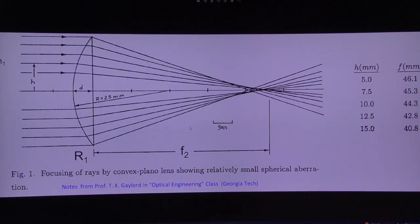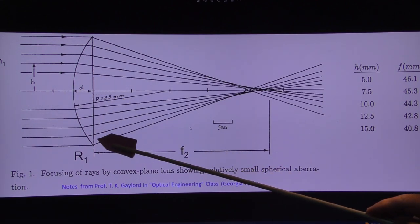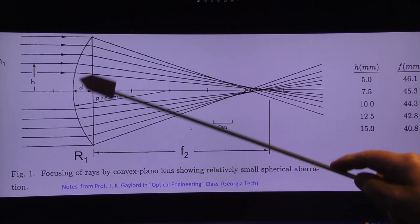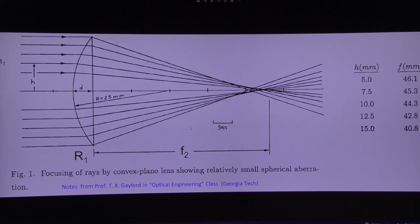Now, all lenses that are used in the CO2 laser are this shape here. They're what they call spherical. That's part of a sphere. And unfortunately, spherical geometry in a lens comes with its own problems. Does that look like a focal point? Obviously, the answer is no, because it's a mess. It's approximately a focal point, and I would probably describe it as a fuzzy focus. There's no such thing as an exact focus. That's the way in which the light rays pass through the lens.